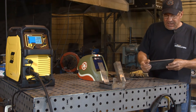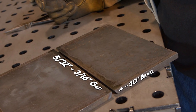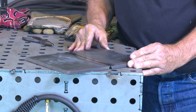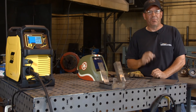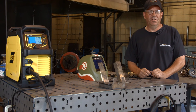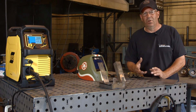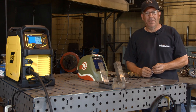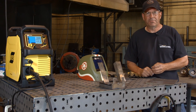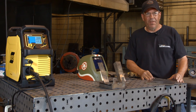I have plates with a 30-degree bevel. I want to fit these with about a 5/32" to 3/16" gap, and I want to run a downhill root today. There's some argument about whether you run uphill or downhill and which one's stronger. I want to show you that this is a good process — we've used this a lot in the piping industry, especially on rolling pipe where we're using a flux core process to filling and cap. It's an approved procedure; we've tested it and it's strong. So I want to get some gear on and tack these plates up and run this downhill root for you.